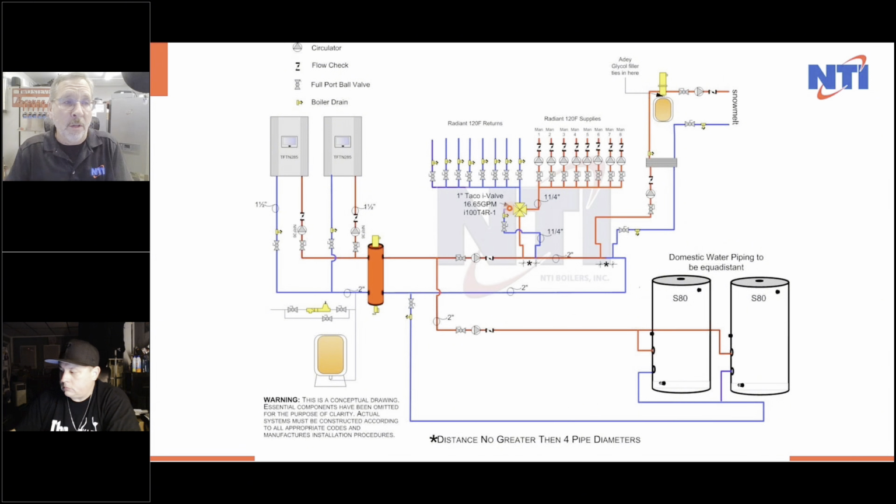It's full open throat. You size it for the flow of everything. Don't oversize it. Better slightly undersized. This valve can open and close on its own to allow 100% through or regulate it down if it's too hot. Then we come back here. We have nice protection because we figured our flow rates here to have it enough. So we had a 20 degree delta T. We let this have a 35 degree delta T and have a great time out on the snow melt. The snow melt didn't get injured.